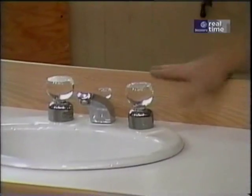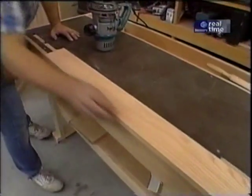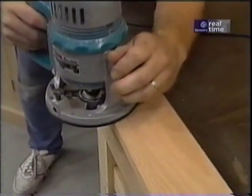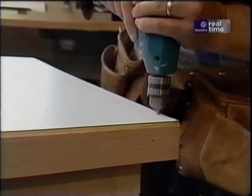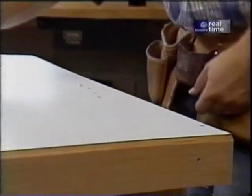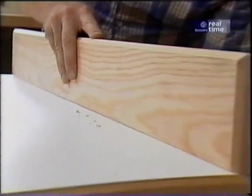The next thing I want to do is make this oak backsplash. I've got a piece clamped down in the vise — it's about four inches wide and I'm going to chamfer three edges. I've just drilled three holes along the back edge of the counter for screws which I'll put in from underneath, and they will secure the backsplash in place.